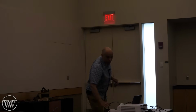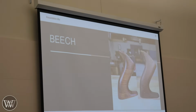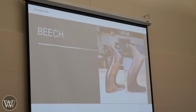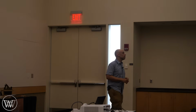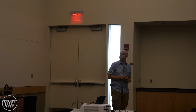And we'll finish up with just a quick before and after. And this is basic wood refinishing just applied to a tote. But it's a really big difference from a few minutes of work. It's about 10 minutes of stripping it, and then staining it and letting it dry, and then 2 coats of shellac. And what I love about shellac is it dries in 10 minutes. So I get 2 coats on the thing in about 20 minutes, and then it's done. And I think the before and after really works.